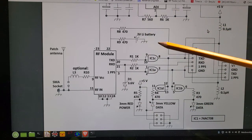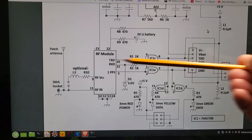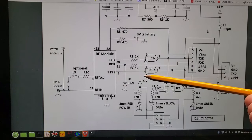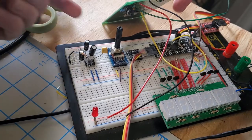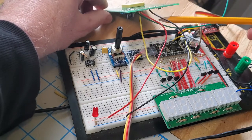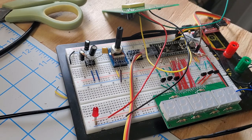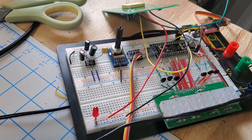I've pulled that together — I've omitted all the level shifting circuitry. The TXD line is the yellow wire; I don't need anything on RXD since I don't actually need to send anything to the RF module. I've got a green wire for the PPS line — you'll get one pulse per second when the GPS is locked onto satellites. Here's the partially populated GPS board with the yellow wire coming from the TX of the RF module going into USART6 of the STM board. The green wire is PPS. I'm simply powering the board from 5 volts.